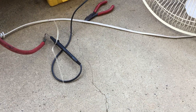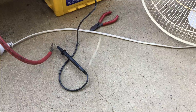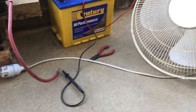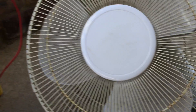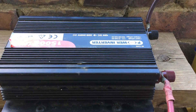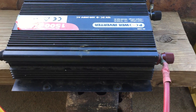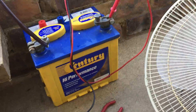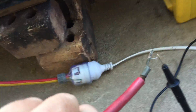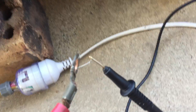It's pretty fine stuff. You can hardly see it there — nice fine wires. I don't know what gauge it is but it's 8 amp. Now, how I've got this rigged up: on a small fan, got a 1500 watt 12 volt inverter. I didn't know how to put the load on it so I thought this would be the best way of loading it up — just a battery, some cables, a little multimeter up there, and a piece of fuse wire that you can't hardly focus on.